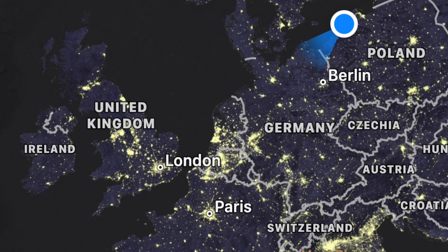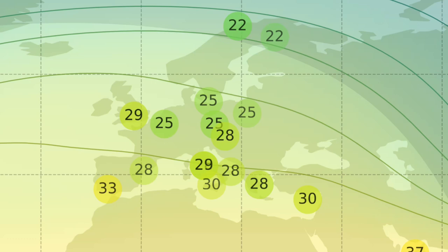The MUF, the maximum usable frequency, took them out. I'm way up in Northern Europe. I don't know if people really understand how far north I am, but the MUF daily was only getting up around 25, 26 megahertz. So it kind of took the 10 meter band out of play. But I kept watching and tried later. Here was the typical Europe type QSOs I was getting, even on 40 meters. This thing was short for 40 meters. Just a quick shot from 40 meters with this antenna in this configuration.